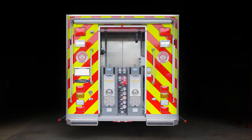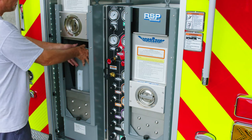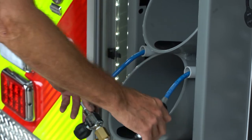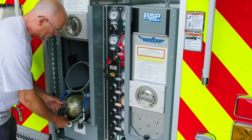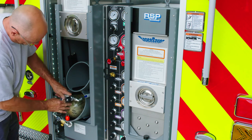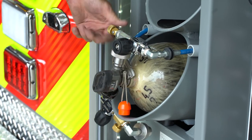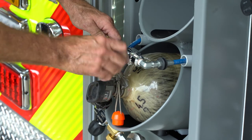Installing two of these units provides the flexibility to fill one to four SCBA cylinders simultaneously. Place one hand on top of the latch box and one hand on the D-ring handle. Turn the handle clockwise to open. Slide the door to the full upright position. Tilt down the SCBA holders and pull out the fill connectors. Load a cylinder into the lower tube. Next, connect the cylinder with the right side connector. Close the bleed valve, open the fill whip valve, and then open the SCBA cylinder valve.